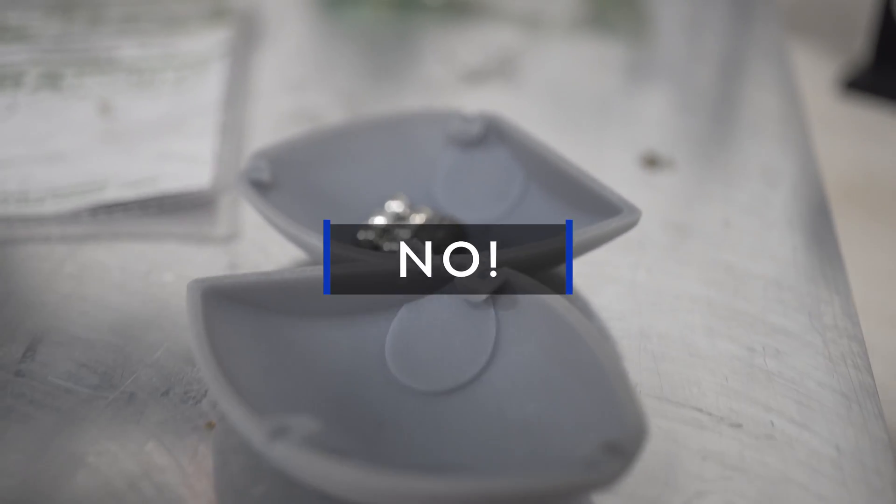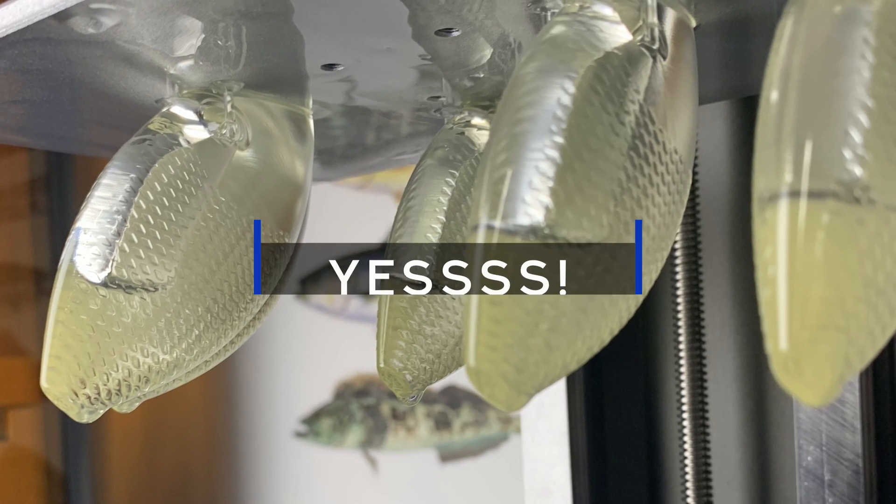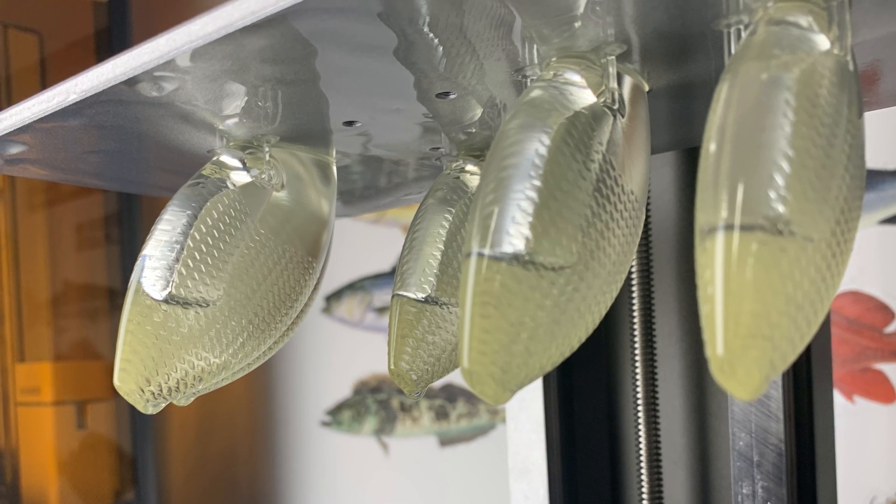The second goal is no gluing. I don't want to print halves and glue them together — that is prone to all sorts of alignment problems, and it's really an unnecessary step in the way we're going to do things here. Number three: no ballast weights if I can help it. If we want to add weight to get it to sink further that's fine, but I'd really like to have all weighting integrated into the body, whether that's a solid body, a hollow body, or a partially hollow body.